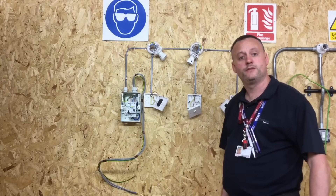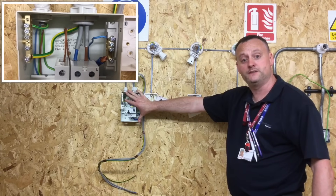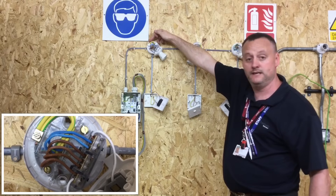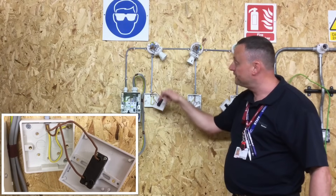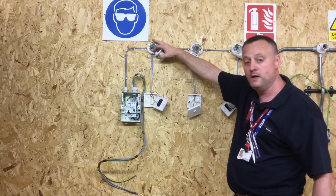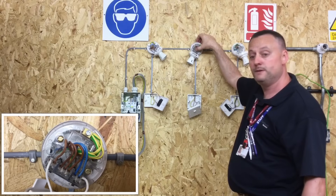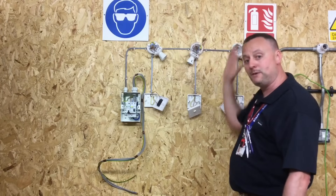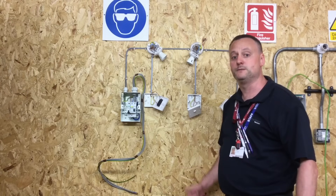So along with the lesson in the workshop, we can see the three-plate looping method. From the consumer unit, the cable runs to lighting point one, dropping the permanent line into the looping terminal, the neutral into the neutral termination, and the CPC into the earth termination. We take a permanent line down from the looping terminal to the one-way switch; the switching line returning goes against the side of the lamp for control. We repeat: permanent line, neutral, and CPC to the next room, making the same connections. We keep replicating this throughout the installation for one-way control in each room. I will also cover two-way and two-way and intermediate switching in other presentations, but this is the basic principle of the three-plate looping method.